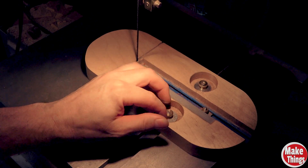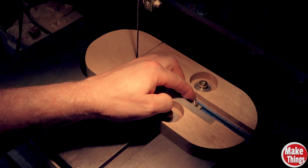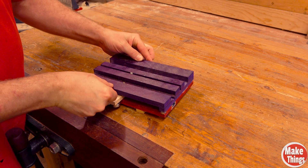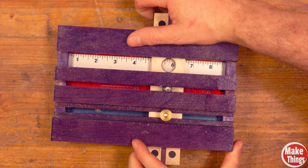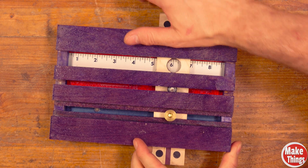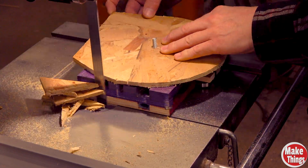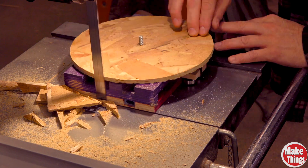A jig I've made before is a circle cutting jig, but it was flawed — I had to use a thin blade and was forced to add a hole to the center of any circle I cut. The new circle cutting jig locks over the base and the sliding miter arm works off the ruler. With a view window, I can lock it to the radius size I'm looking for. Because I don't have to lock this jig into the miter slot like the last one, it doesn't matter what blade I use as I make multiple cuts and finish off with a spin at the end.